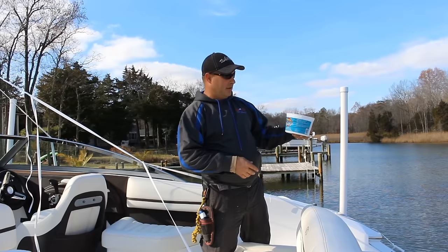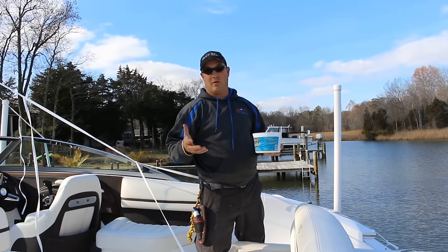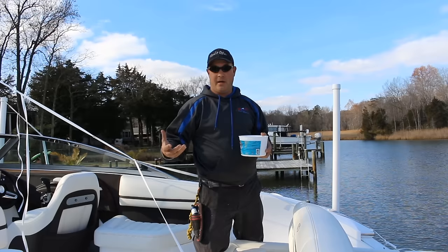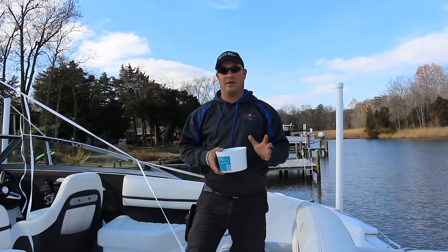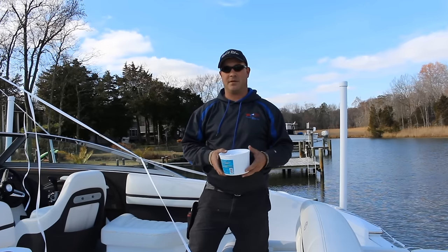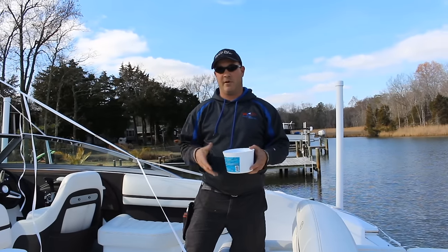What I found here inside the customer's boat is a Starbrite No-Damp Moisture Absorber Dehumidifier. It's a great product and it works well, but it doesn't have a very long life because of the moisture that gets inside of a boat every evening — the boats sweat. The one thing you must make sure your shrink wrapper does is ventilate the boat properly. That's your best bet against controlling moisture, mildew, and dampness. The boats will sweat every night even with vents, but throughout the day the crossed winds going in and out of the boat will dry it right back out.